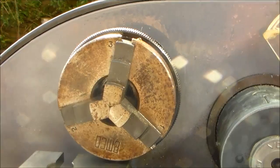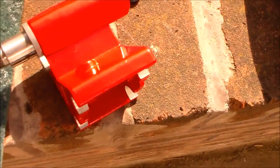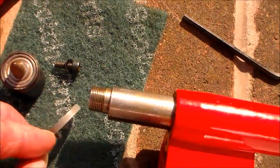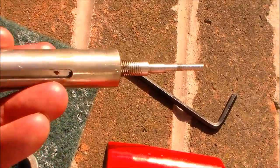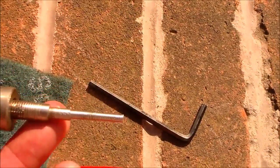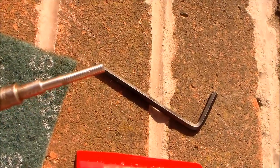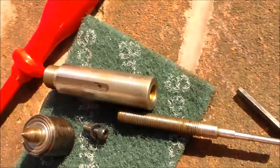Anyway, we'll do a little bit of testing and a bit further breakdown of the tailstock. By taking that little screw off and removing the aluminium part, the tailstock barrel comes out. It is a truncated barrel, but the truncation is caused by this threaded section — it looks like the threads at the very end are ground down.